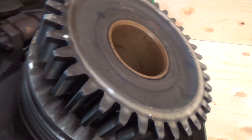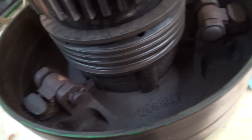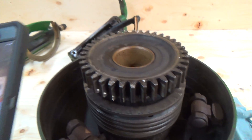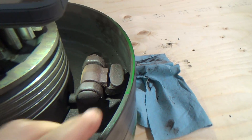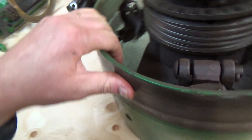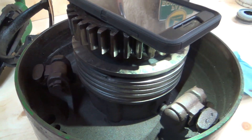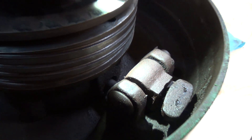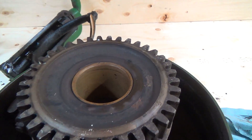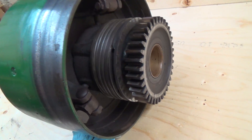Let's flip her up on this end here. These little dogs - I think they call these dogs - I've got one that's broken. If you can see these little ears that come onto these bolts here and adjust that clutch plate on the front, I've got one here that's broken - it's missing its ear. So I don't know whether I should order one and stick one in. These things are $30 a piece. It's been alright so far, so I'm probably not going to order one, because like I said in my other video, if I'm taking this out in the field for eight, ten hours a day, yeah, I'd probably be ordering one. But this is going to be like start it up, put it on the trailer, take it to the show, start it up, park it.